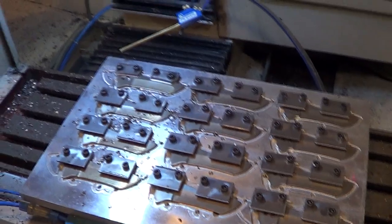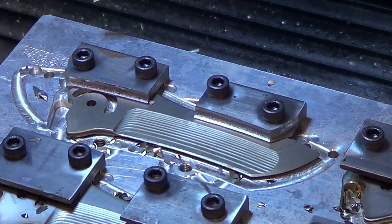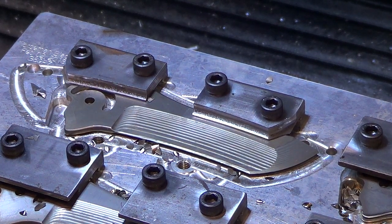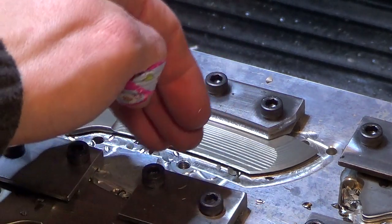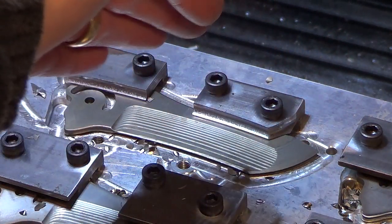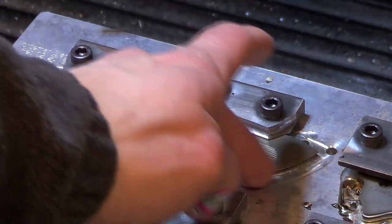It might make more sense if I zoomed in on that. You can see the first set — left and right — and it mimics the shape of the blade very nicely. This is rough milled, so those milling marks will end up going higher and farther in on the tanto portion once it's reached the final depth of edge milling.